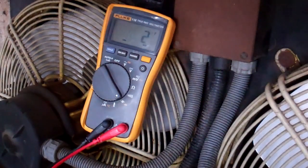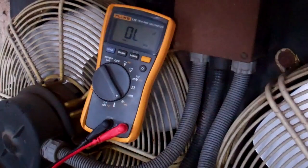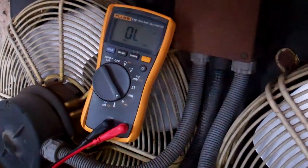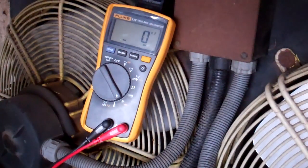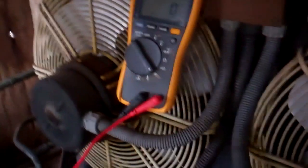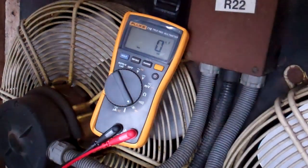It's a 10 and this one's a 5. No, it's not doing anything. Let's make sure we've got a good connection. No, that one's gone bad - that's that one there. It's only a 5, so even with seized up motors those only pull about 2 or 3 amps, so I doubt that's a problem. It's a bit all jammed in inside there. Anyway, we'll get that wire put back on and we'll change that one.